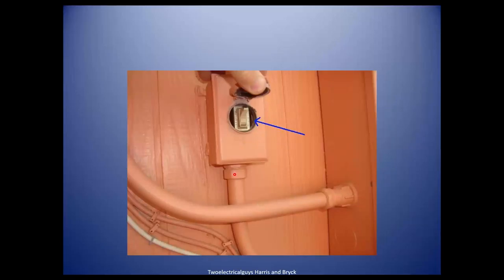What's wrong with this switched receptacle? You're missing your gasket to cover the switch opening. Is this cover plate for a round outlet instead of a switch? If you had a gasket, it would probably be the right type — they supply two types: one round for a single receptacle, and one for the cutout of a toggle switch. You should write these up because you can touch the inner yoke of the switch through the opening.